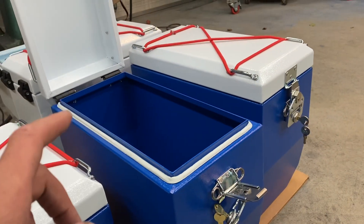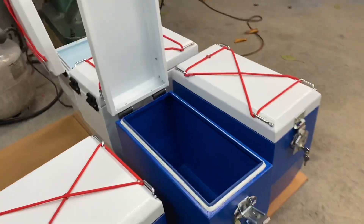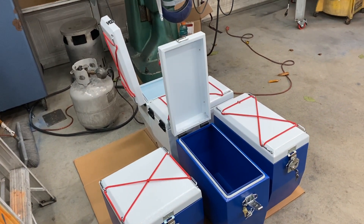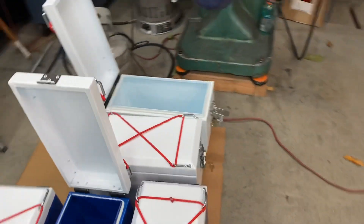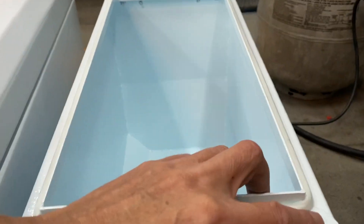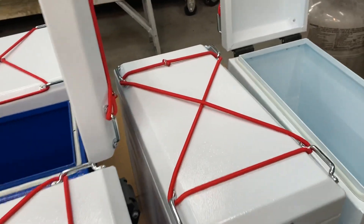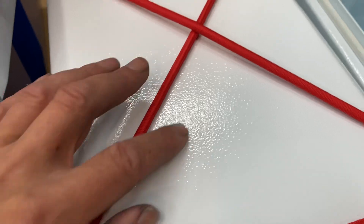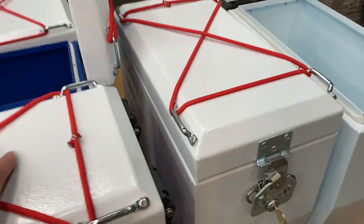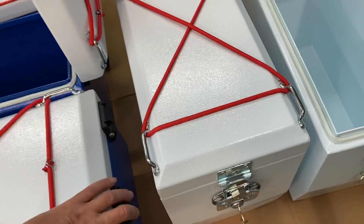I originally thought I was going to do the red, white, and blue in a hammer tone, which is totally different from this textured finish. There are still a couple other colors they offer in this same texture, which is nice. I could probably also do custom colors that don't have a texture at all, but I like having the texture because — kind of like the texture on the walls in your house — it's there to hide little imperfections. You can see where my weld is right here and it just makes little things go away. It's beneficial down the road once you own these too, because they get scuffed and scraped. This weld would stick out a lot more on a perfectly flat finish, so the texture is there for a reason.